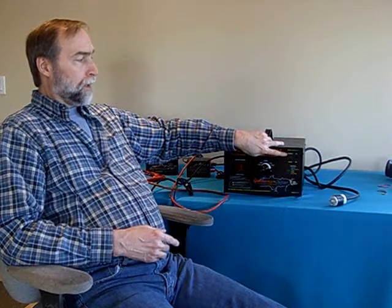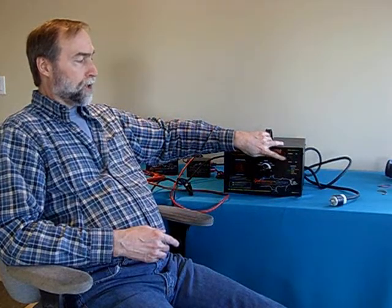It has the capacity of about 30 amps at 12 volts, and as you can see over here on this switch there are two settings: one is called charge and one is called cycle. When you put it on charge, it automatically senses the battery, charges it up to its full voltage, and then puts it into a float mode so that it will stay there until you take it off the charger.